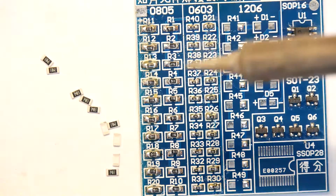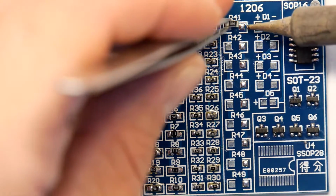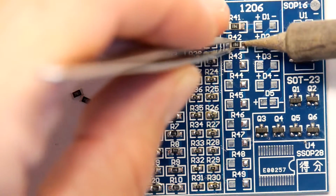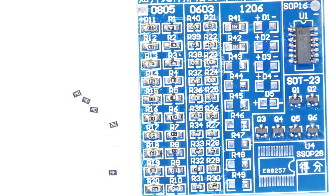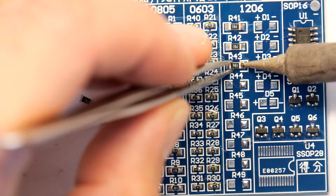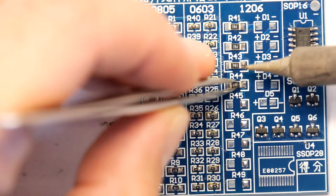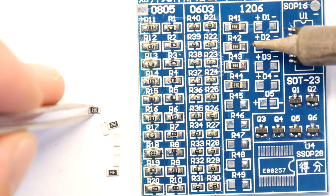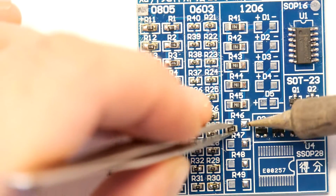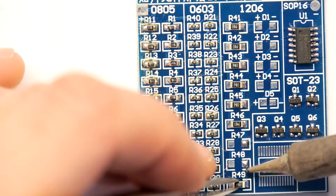It's strange I haven't used a footprint on the silk screen. You know, that's the drawing on the board, just showing where the line is. I think that would be infinitely more useful for someone having to hand make them. If you're designing your boards in a CAD package, bear that in mind yourself. If you're not going to want to remember which way things go around, just make sure you use the appropriate footprint that shows you exactly which way it goes. I mean, that's the point, right? You don't want to have to pay engineers to assemble PCBs. You want to be able to pay people, well, probably kids, I guess, in the Far East to assemble it for you.